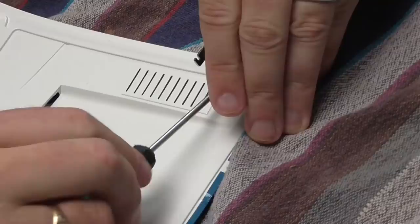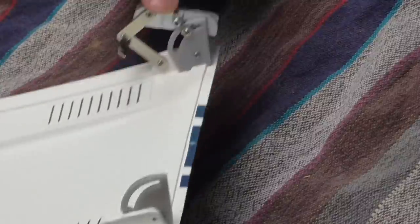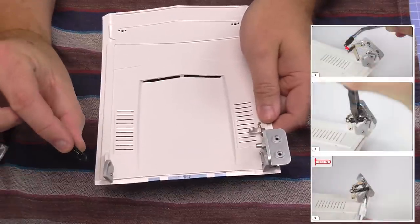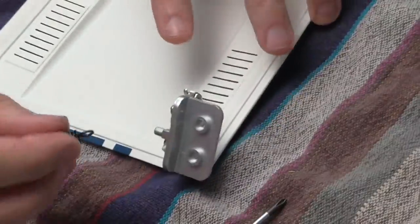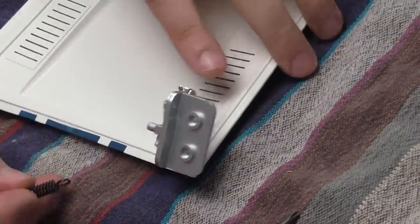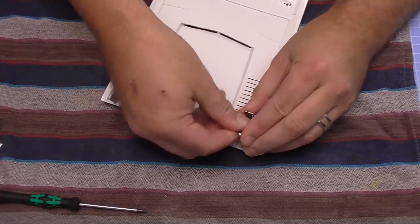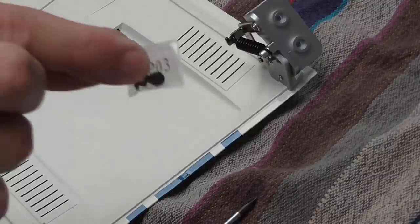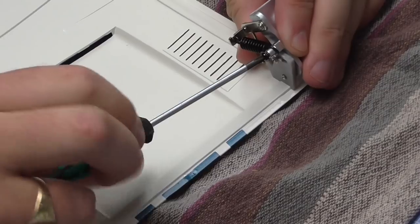Again, don't make this too tight — just enough to keep it in place. You want it to do the whole circuit of that semicircle, going all the way down and all the way up. Now we spring-load it: the spring goes into the lip and round the lug at the top. I recommend putting the hinge all the way up, then getting the spring over this section and that section. To stop the spring falling out we have MP03 screws with big flanges — put that all the way in, and then we can operate the hinge with spring assistance.